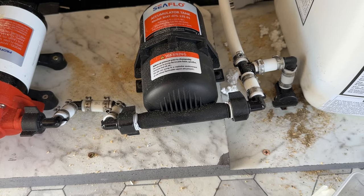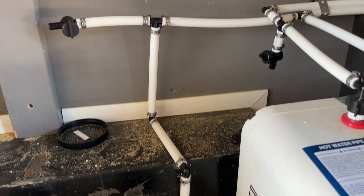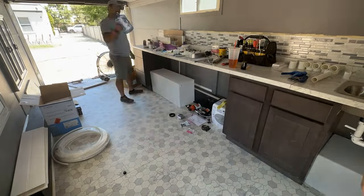From there, the piping tees at the water heater and continues to another tee for the triple sink and one for the coffee filter. I add another ball valve before the coffee filter to make changing filters easier. I put the coffee filter after the bartender rinser — that way I'm not filtering water used to rinse dishes, which helps preserve my filters. The piping then continues to my hand washing sink and triple sink for cold water. You spend the day dry fitting all of that, make sure everything fits nicely with nothing bent or under pressure, then the next day you come in and crimp everything down.